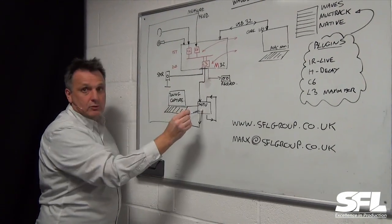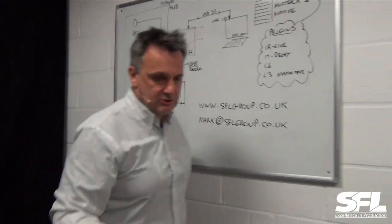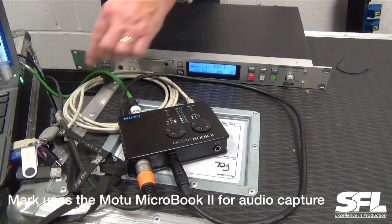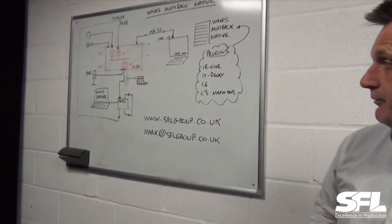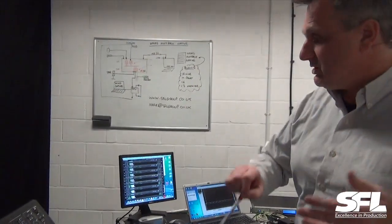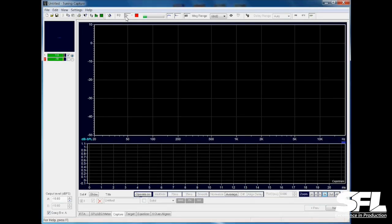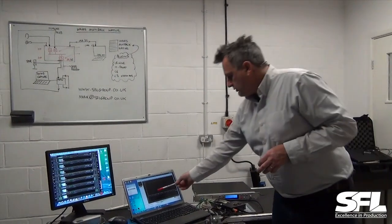The signal goes through the system and is sent back to the sound card, so we send a noise and then measure the noise. Tuning Capture measures the delay using its own loopback reference — an output feeding back to its own input as time zero. We also have an output going to the mixing console and returning, so the device measures the delay of that path against the loopback reference. Here we're using it in an electronic environment with no speakers — going into the mixing desk and directly out again. At the moment there are no inserted effects, so we're measuring purely the console path.